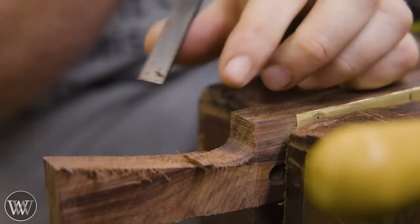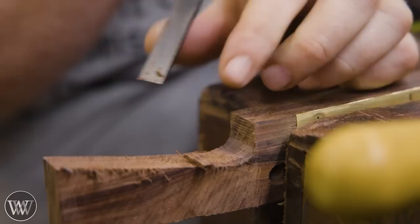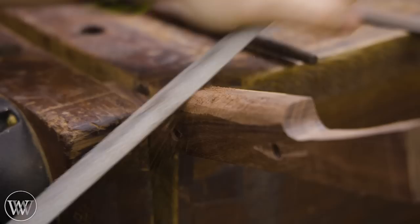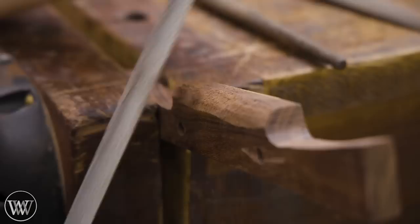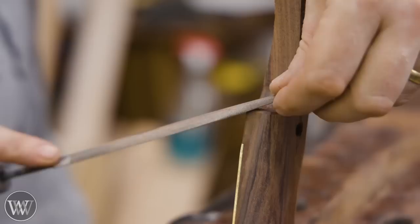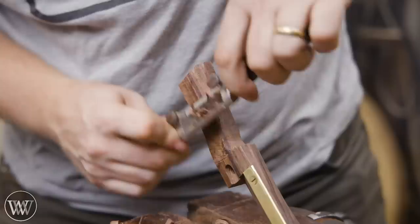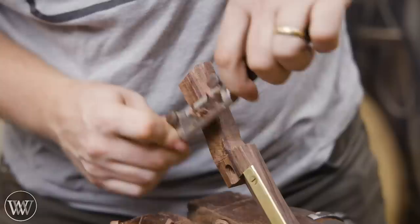To clean that up, I can just come in with a chisel and ride the bevel and scrape it down for a really nice clean cut. We're going to do a lot more little detailing — on the back side it needs to be rounded out, but at this point it's all for the look and feel of it. A rasp makes very quick work of getting that to the right shape. Come in with a file, smooth it out — it has a slight indent in the middle and curvature on it. On the back of the escapement, we're going to lighten that up a little bit. Any time you can get rid of a little material, it makes the whole tool lighter and provides more area for the chips to come out.